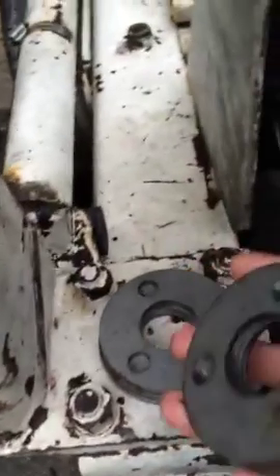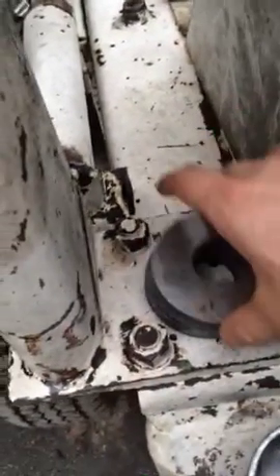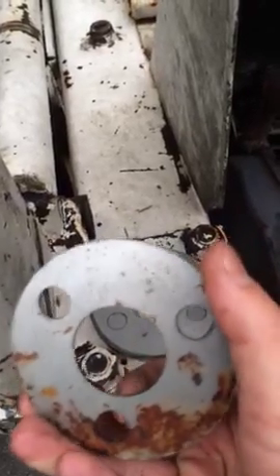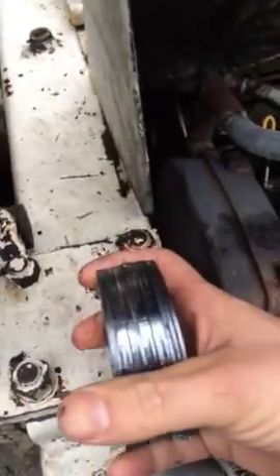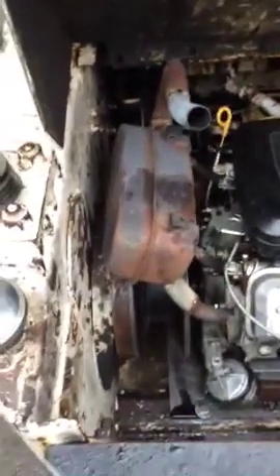Bolting this together — you can't see because the belt is on — but I have these discs in the center, and you're really going to need these. I tried doing it with just stainless steel bolts, but you get a lot of torque there. So I had a buddy fabricate these. If you've got a sheet metal shop nearby, just draw it out on paper and give them dimensions. I made the bore a little bit wider, and the half-inch holes a little wider than half-inch just to accommodate. You'll need to add or remove discs — more discs means slower speed, fewer discs means faster speed, with the gear ratio. It's trial and error.